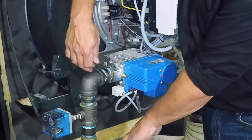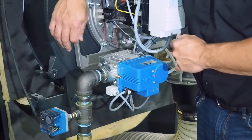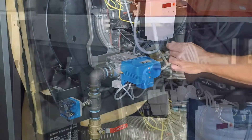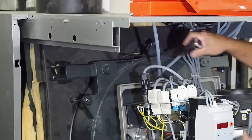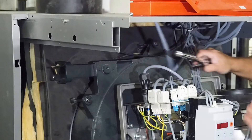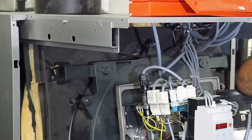At this installation, there are two gas valves — one here and one on the right side of the boiler before the regulator. Make sure they're both off. To remove the burner door on the CM2-620, loosen six bolts: one at the top of the heat exchanger, two on the side, one on the bottom, and two on the right side. Once all those bolts are completely removed, the burner door will swing off to the right.